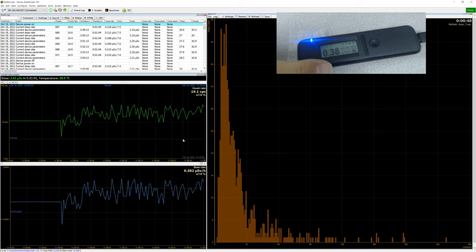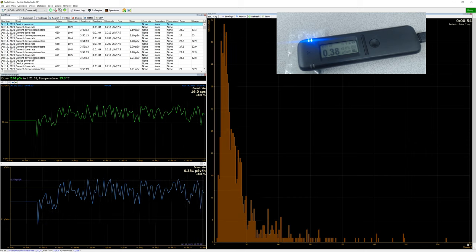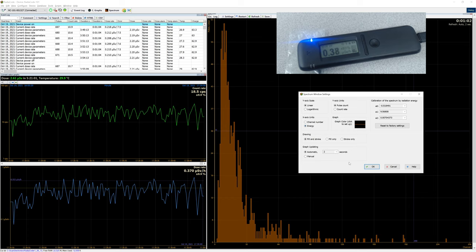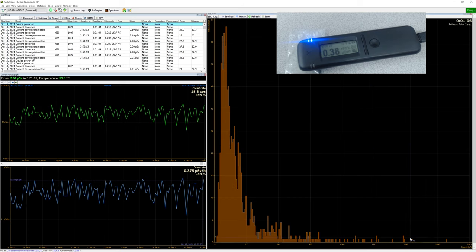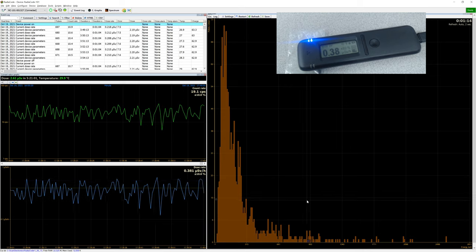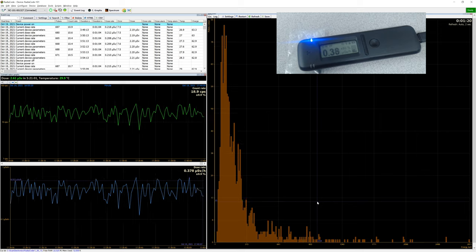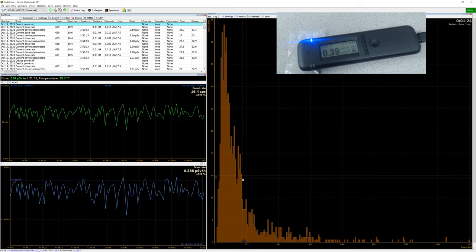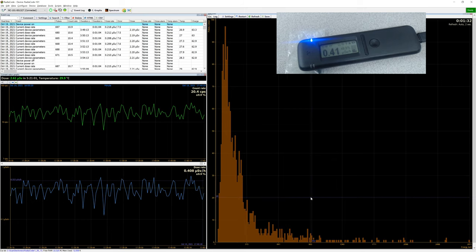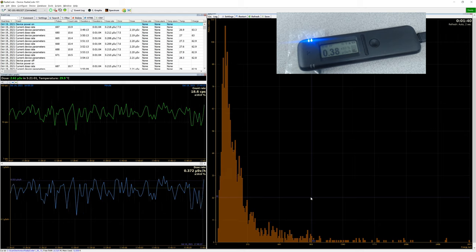You can see it's going straight back up to almost the 40s level and you can see the accumulation here — this is 256 bins. If we switch the setting to energy level, you can see something down here around 528 and something here at 304. I haven't looked up exactly what those correspond to, but on the Android software it has a built-in database that gives you an idea of what the peaks are. If you want to be sure, you would want to calibrate it. This is nearly double the background from this thorium welding rod.